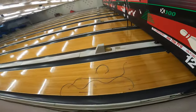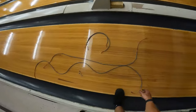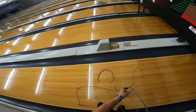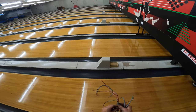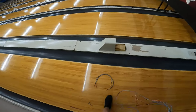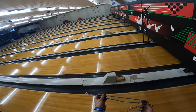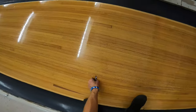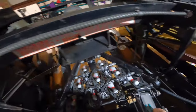Now we've come back out onto the lane in front of lane 12. I've already pre-made the wires we're going to need for this project. This very long wire — approximately eight and a half feet long — is the one we're going to run from our p-box into our table. This wire, approximately six and a half feet long, will run across our table raceway from each side to connect our two terminals. These two wires, approximately three to three and a half feet long, will go from our table to each of the terminals. Last but not least, we have our two ground wires for our terminals on the table rods.